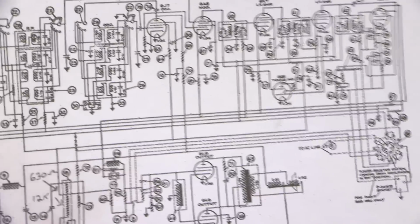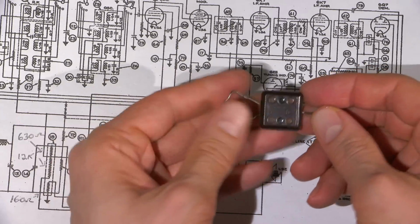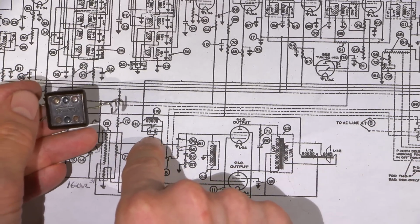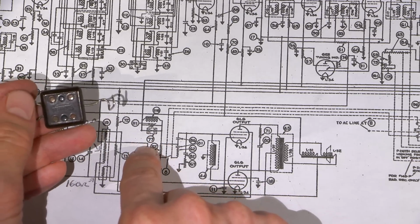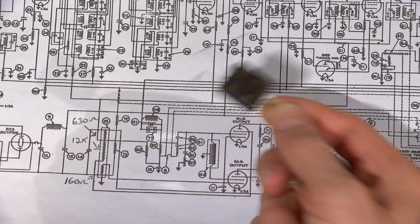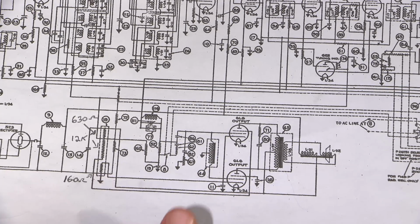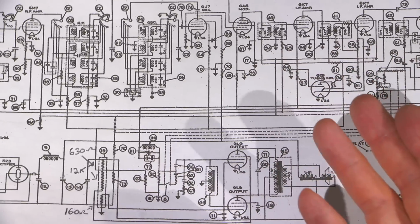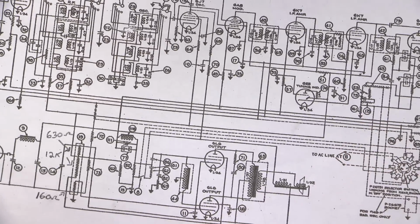So these capacitors here, these 2 want to hang out together. So these ones here are down here. So there's one of them that's down here. All right, that's right across this particular unit right here and right to ground. So it's funny, they show a dot in the center, but they don't show it tied off to ground, but it is actually tied off to ground. So one of these caps right here, and there's a few things in the parts list here that aren't even listed, which is kind of interesting. The parts have a number on here, but they're not listed, i.e., part number 175 isn't on the list.